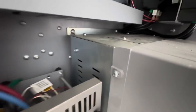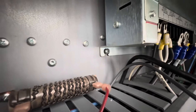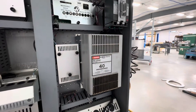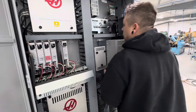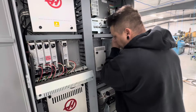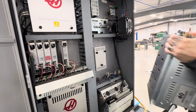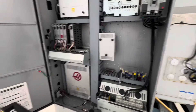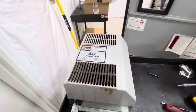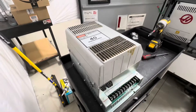So the screws are loose. If you notice in the sheet metal, there are slots — basically these are just hangers and they all have slots on the bottom. All you have to do is loosen the screws and then just lift the vector drive up and it should come out. That's the vector drive out. They are a little heavy, so be careful picking them up and getting them out of there. But yeah, no big deal — pretty straightforward. Let's get this thing boxed up and ready to ship.